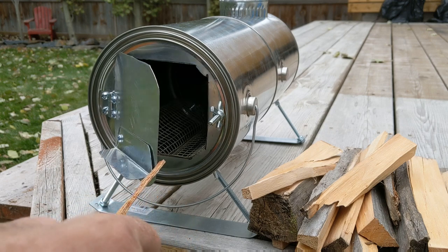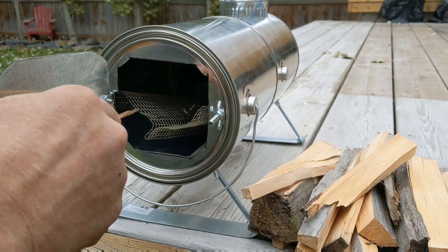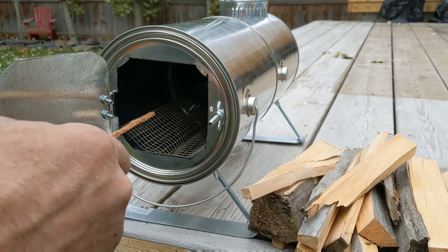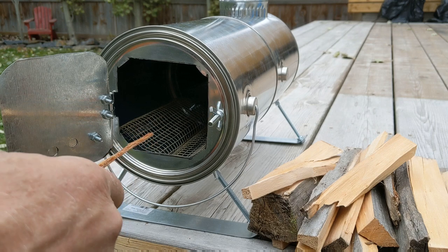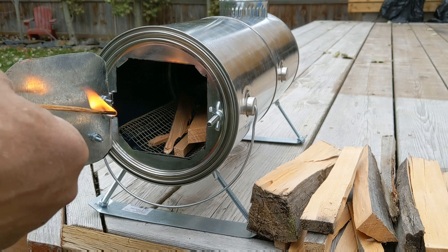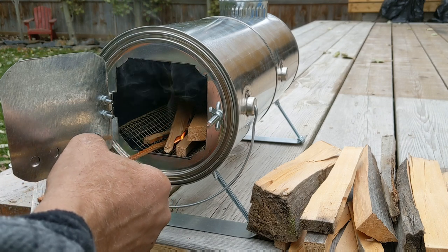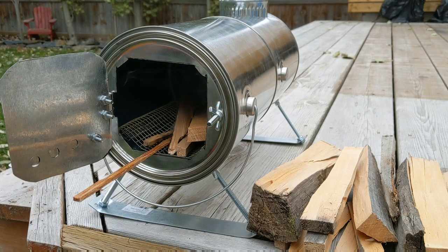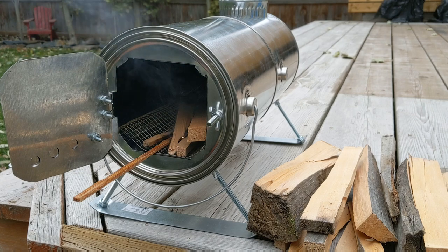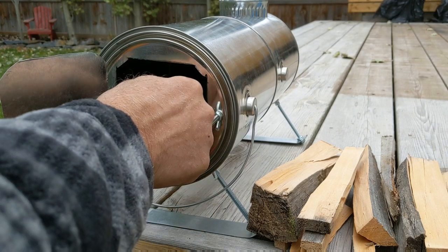Okay, I've set up for the burn test. Before I put some wood in there, whenever I build these little wood stoves I always put a piece of chicken wire in the bottom — give it a little bend so it sits about half an inch off the bottom. This does two things: it promotes airflow underneath your fire and also protects the bottom of the stove from burn through. Just something I've always done, seems to work quite well. I've got a little bit of wood in the stove — just going to add a little bit of flame using a piece of fat wood. I always like to have a piece of that along; makes getting a fire going easier, especially in these wood stoves. As long as you can find a little bit of dry wood you can get your fire to spark up fairly quickly with a little bit of fat.